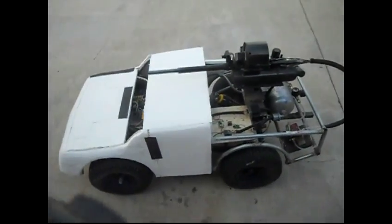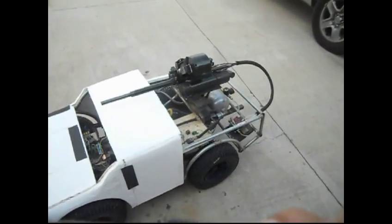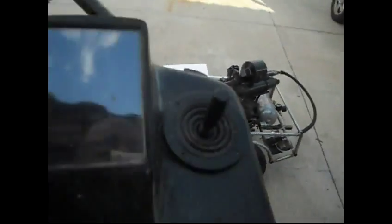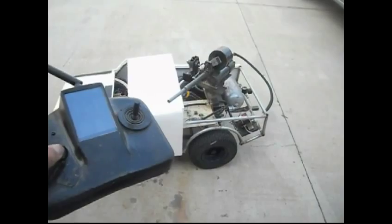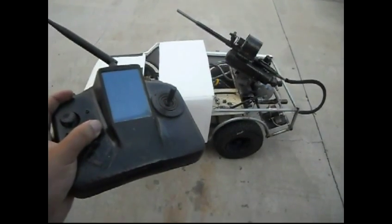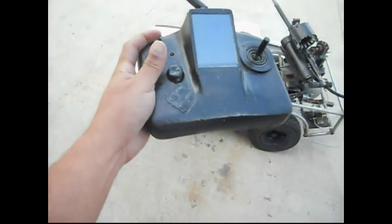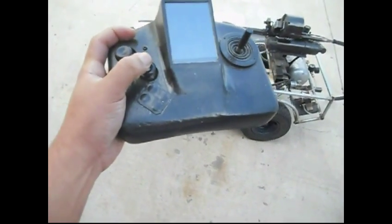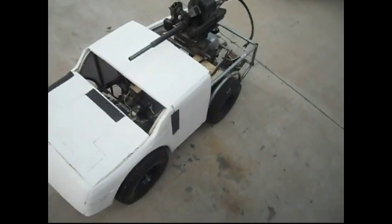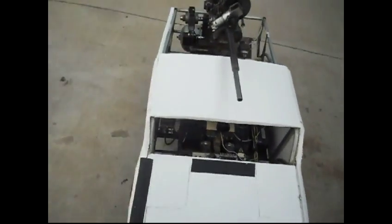So, here it is. Obviously, that's the feedback mode. Wherever I hold the stick, that's where it stays. Then there's feedback loop off, so I can actually move it to certain degrees. Basically that's position hold. And of course these are PS1 PS2 sticks, so if I just tap the button again, it snaps back into the other mode. That's the good thing about having a microprocessor in place over a regular RC control system: you can program different modes of operation and get it to work the way you want.